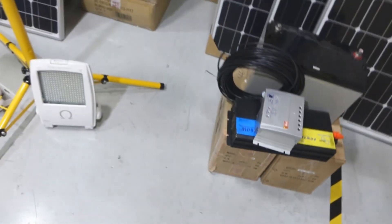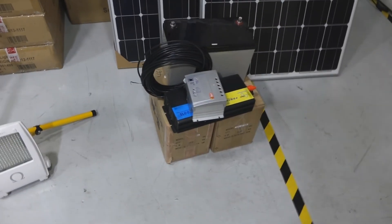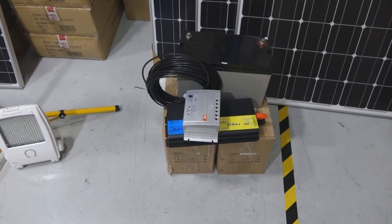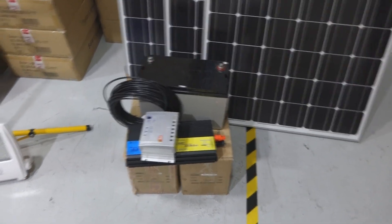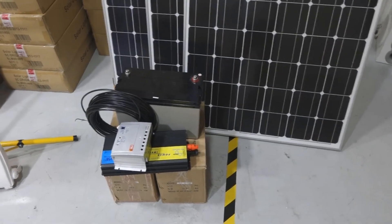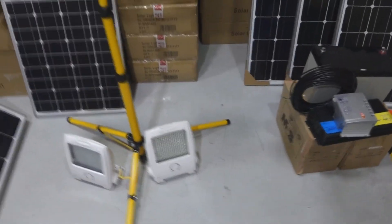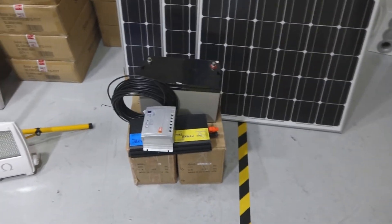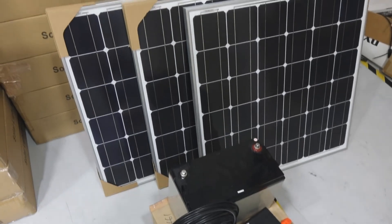So you power the floodlight in AC to reduce voltage drop. Of course, you have to calculate whether using an inverter with 30% power loss, or using a smaller cable where the power loss might be even greater than 30%. This is something that most of our competitors do to power a billboard — just to power 4 units of floodlights achieving maybe 8,000 to 10,000 lumens, they need so many components and such heavy weight.